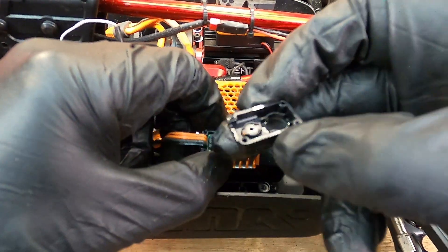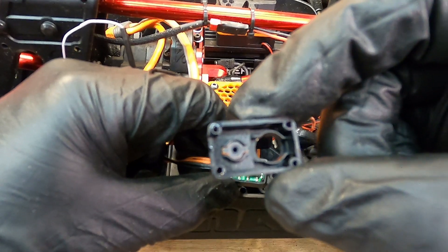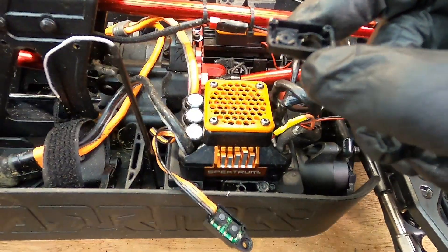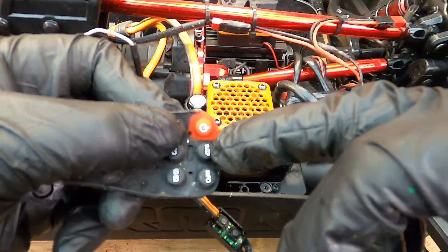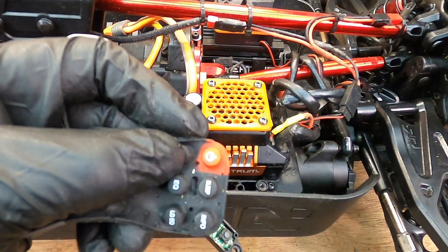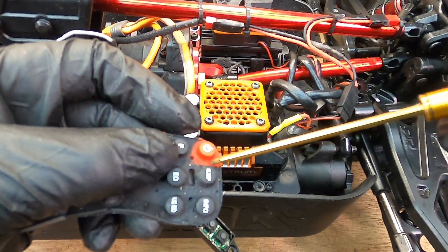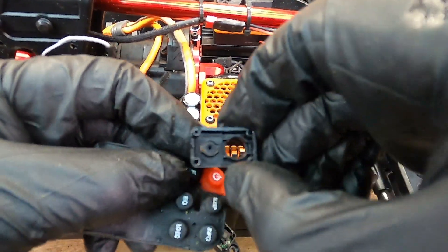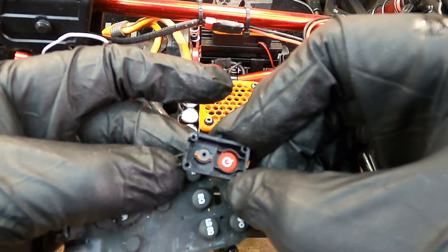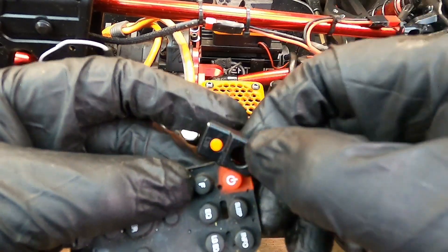There you go — you've got two buttons on here: one is the set button to program your ESC, and the other is the power on/off. You can see the set button is still in its place but the power button is missing. What I want to do is remove the on/off button and trim any excess rubber with scissors so I can fit it into this space. There's only a certain amount of space available, and we also need to check whether this button will fit — and it fits perfectly, actually. That's quite lucky.